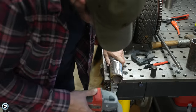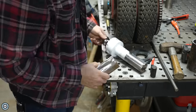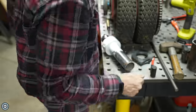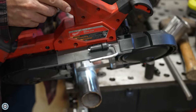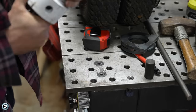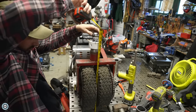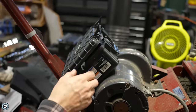One of the dangers of using a trailer caddy like this is the ball-and-socket — you really want to reduce the movement you get from it, hence this whole threaded locking system. Once I cut the welds and got everything fitted up, I checked the actual height and made a cut to shorten the adapter. It probably seems like I cut a lot off, but it's going to make this just the perfect height so I get adequate tongue weight without worrying about the trailer doing a wheelie. Both me and Mac's trucks are about 20 to 21 inches, and it winds up being perfectly exactly where I want.